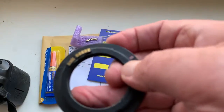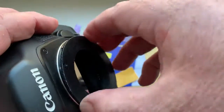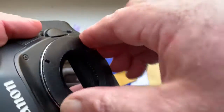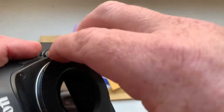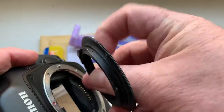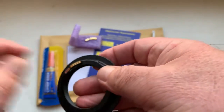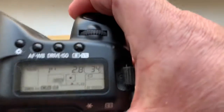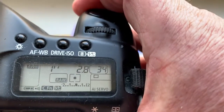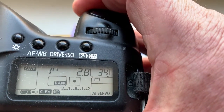Then remove dust and degrease the place of installing the chip, and then install the chip with super glue gel. And the chip number 2 — check it. I pre-programmed it: focal length 1000mm, aperture 2.8, delay time to enter programmer mode is 1 second.